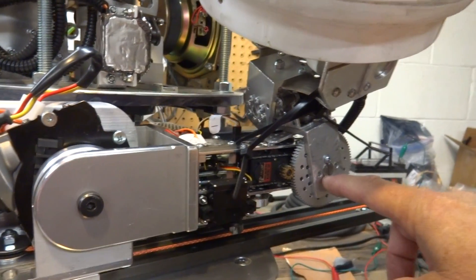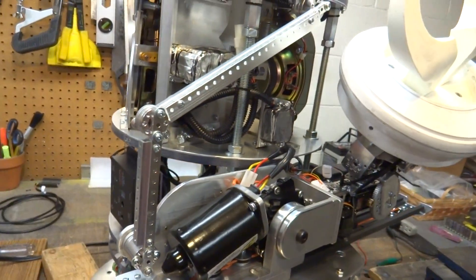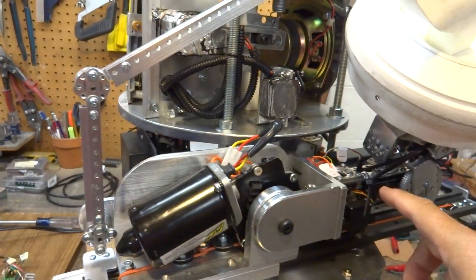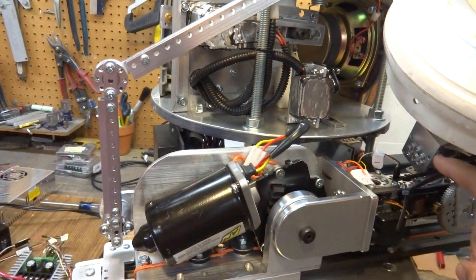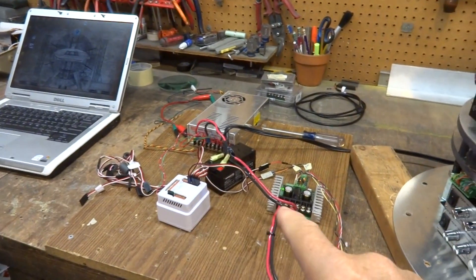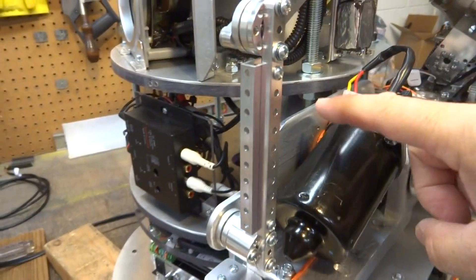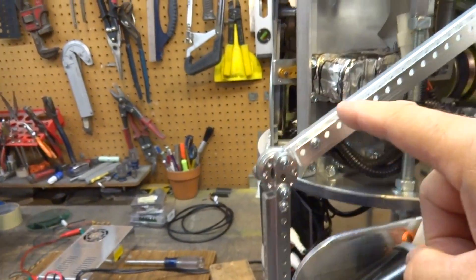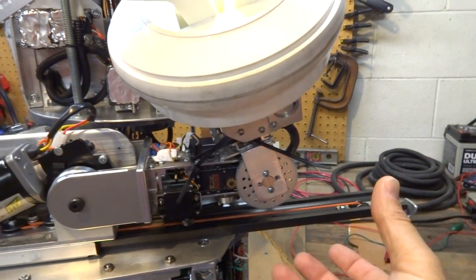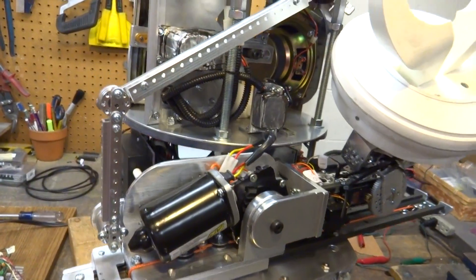The rest of this mess I had set up for the servos on the main arm itself. Right now I've got the wrist locked back, the elbow locked down, so I can test all this and get it running. It's running pretty good. Now, you're probably wondering what this is — this is going to be my cable management system. I'm going to have to get power for these motors and the signal cables for all my various servos back to the EZB and the Sabertooth somehow, which is going to be mounted back in there. Those cables are going to be coming over here somehow — I haven't figured it out yet — but up and around, up to here, and back in and down. This will handle those cables because when this goes out, it'll go out the way to the back and it'll actually be inside the tube of the arm, so those cables have got to go with it somehow. This will bring it in and bring it out.